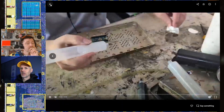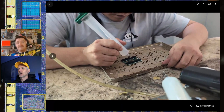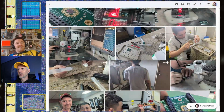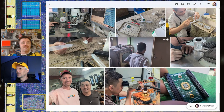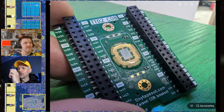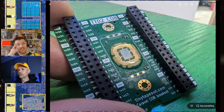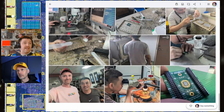For more complex chips, black opaque glue is used to protect against UV, because semiconductors are photosensitive — a very bright flash can reset a chip. There was a famous Raspberry Pi issue a long time ago where taking a photo with a flash would reset it. That's why on this board there are footprints for two little clips — like a radio shield — to fit on top and give protection if needed. When designing a PCB it's easier to add things before than after, like those mounting holes.